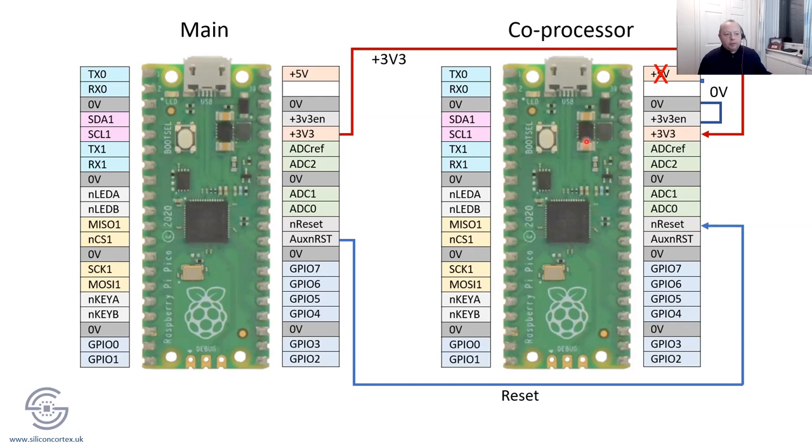This is just two decoupling bulk capacitors. And this here, which I'm just pointing at, hopefully you can see, that's the inductor for the power supply. And this power supply is good for about, I think, 300 milliamps. And then this is the diode. So I would suggest, because this 5 volts actually does power all of this, and again, I don't think it's a very good idea to have power supplies staring at each other, I would disconnect this 5 volts and of course just use this one here, the main one. And so you just put a short link across there, easy peasy.